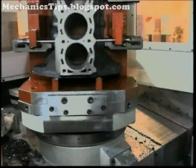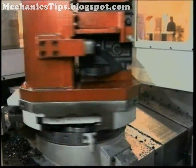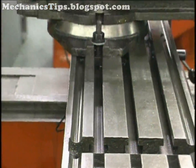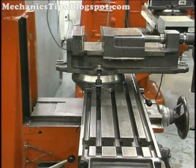The HMC table typically rotates to expose four sides of the workpiece, or fixture, to the tools. The T-slots of the machine table are still the primary means of holding work and work holding devices to the machining center table.